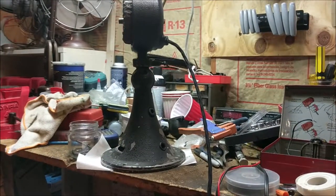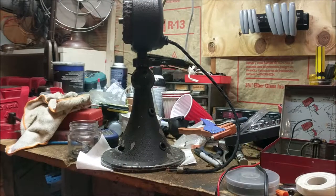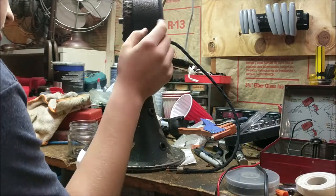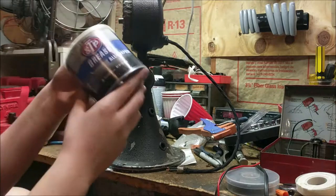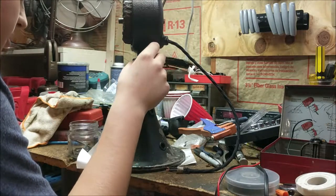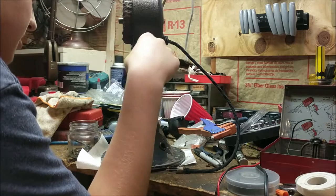About 18 minutes of my video got corrupted, so I'll go over it quickly. What I did was put some grease on the shaft — just a light film — then put it down into the collar. Make sure to clean out all the old grease in the collar as well.